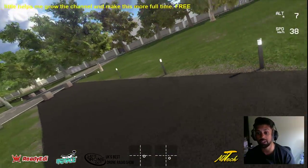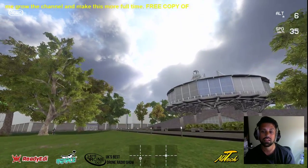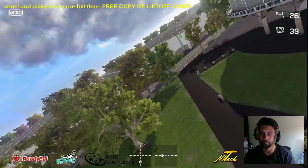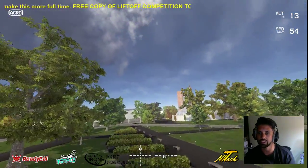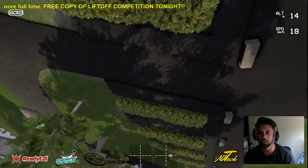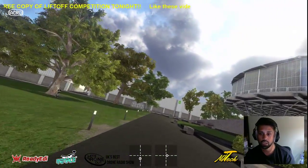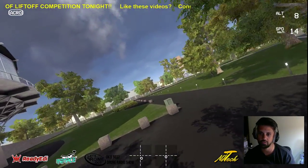And don't forget, you're doubling up when you start putting two 1,000 degree per second axes like pitch and roll into combinations. So if you go into the corner, you end up with ballistic speed. So there's plenty of ways to get things to look exciting and fast without having to go with crazy endpoints. So 1,000 degrees per second at the end, and then in terms of mid-stick information, that mid-stick feel, I just take my time and work up the RC rate until I start to feel like that mid-stick is feeling consistent and good.